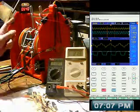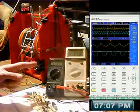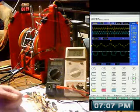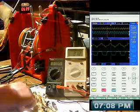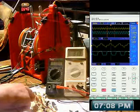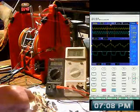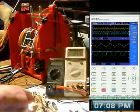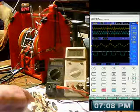We're back to 65 RPM and we've got more current right now. We've got 21.3 milliamps. That's good. That means that having that capacitor delays the gate trigger time. So by delaying the gate trigger time, I'm offsetting it slightly, and I've actually got more current and the same speed, so that's good.